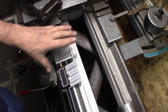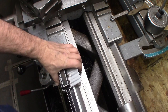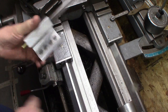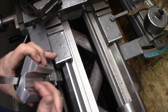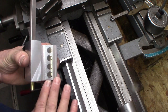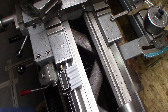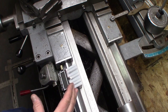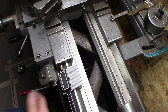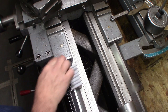There were some questions about repeatability and accuracy in the comments when I showed this. It just sticks on with magnets — you got to wipe it off maybe a little bit. So far I haven't had problems with magnets. These fit very close, so it's very difficult for things to get underneath. You don't have to leave this on here all the time. It's on here no more than having an indicator on there. You can just take it off; you might have to wipe it off so you get good contact with the scale.